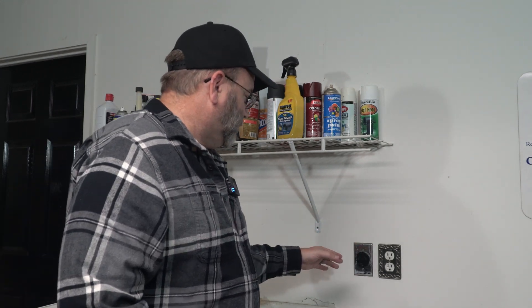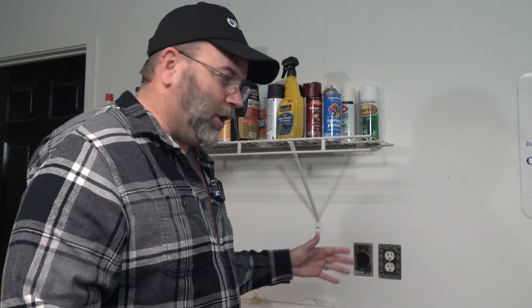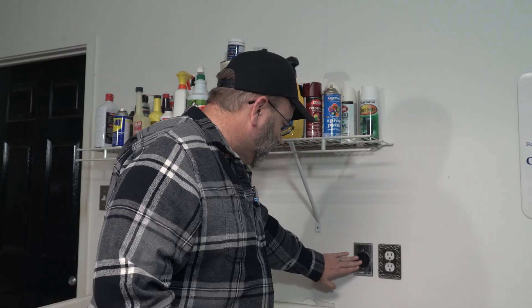Now that we've drained the Guardian 6000, let's charge it up as fast as we can. Using 120 volts, we can charge at a maximum of 1,800 watts. By using 240 volts, I can charge at 3,600 watts, so let's use the 240-volt input and see how fast it'll charge. You might be wondering where you have 240-volt plugs. You probably have one for your electric dryer, maybe an electric stove. I actually have one in my garage, which is handy. My previous owners of this house installed one out here. It's a little close to the sink for my taste, but it'll work. It's a 30-amp plug.